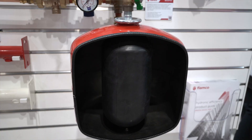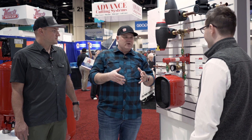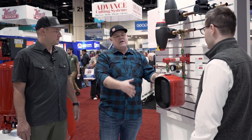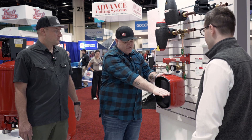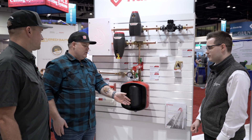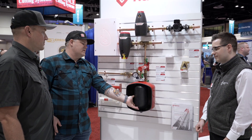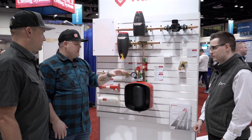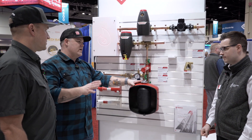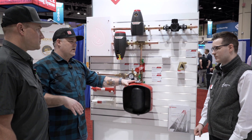I love the cutaway of the expansion tank. I've shown this in a couple of videos. I think it's really important for people working on any type of plumbing system — whether you've got thermal expansion or for potable — though this is not a potable tank, this is for heating — but it shows what's going on inside a tank and the difference. Our typical diaphragm tank looks the same on the outside, but you've got just a rubber diaphragm separating — it's kind of sandwiched into the tank itself. In this case, heating water on top of the diaphragm, air on the other, and that's how we create that expansion vessel. But what's really cool about your tank is you're not offering the diaphragm version in the U.S. — you're just offering this bladder tank, which is not the same as a diaphragm tank. Can you give a quick rundown of the benefits of this versus the traditional tank?